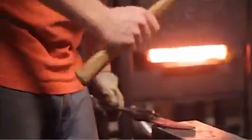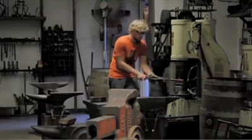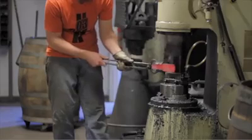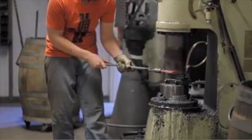The more you cook it, the more likely the steel is to shatter. Once the blacksmith has done as much as he possibly can to the softened steel, a machine is brought in to finish the tapering process. This is the power hammer. It is used for precise and heavy work. It slams down an 88-pound hammer upon the metal, which is significantly larger than the handheld one.